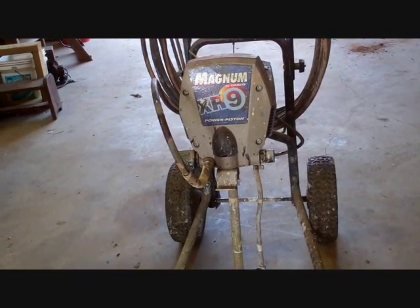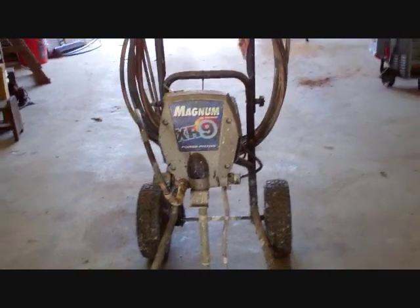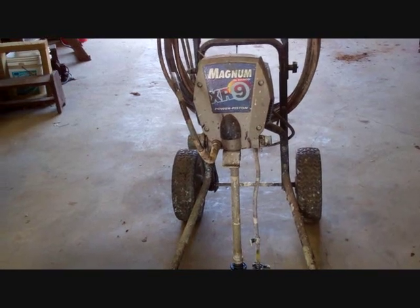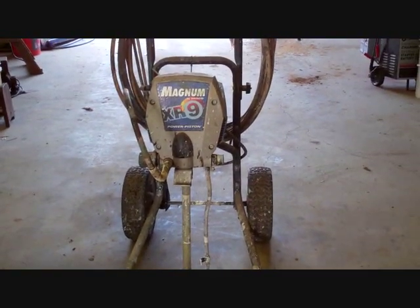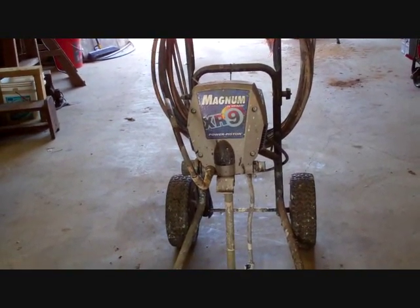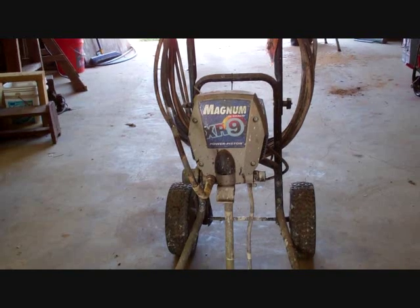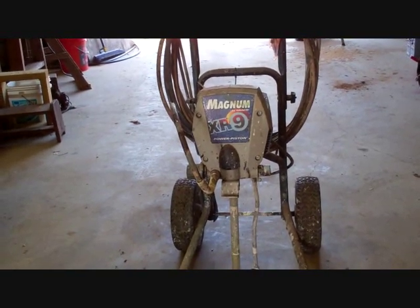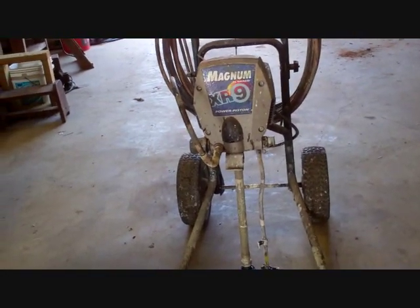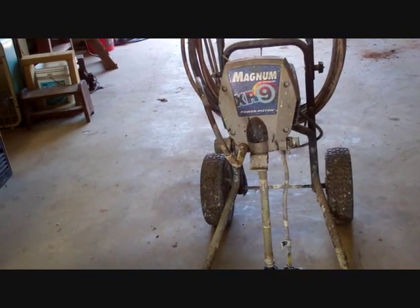I stained my own house with it just recently in the last month or so. And I didn't have to mask off any windows. We were getting new windows, and the old windows were coming out, so I didn't worry about it. I just sprayed and got some on the windows because they were old and fixing to come out. But I sprayed it in about 3 hours probably, and that's about 1,800 square feet under roof. I used 15 gallons of spray and did it in about 3 hours. Another couple of houses I did were smaller houses, about 1,000 square foot houses, and again, 2.5, 3 hours.